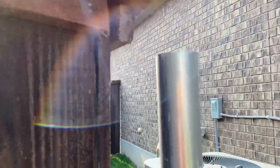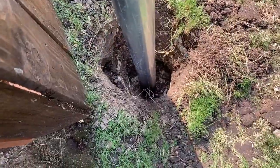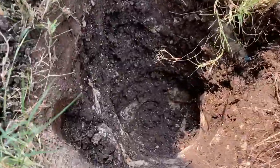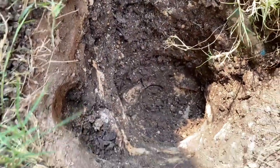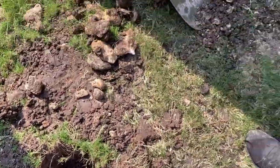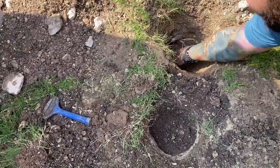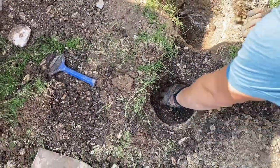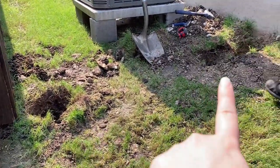These are seven-foot poles. With our soil in central Texas you can see there are rocks down there and the auger will not go past them — they're huge and we can't break them up. He's been working on it for a while. He has the other two holes dug as well for the other braces — one will be the end support and this one will be the support for the other side of the door. We're about to set the poles in these three holes he dug.